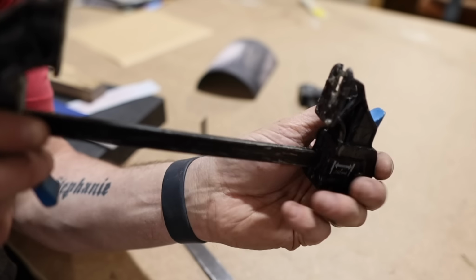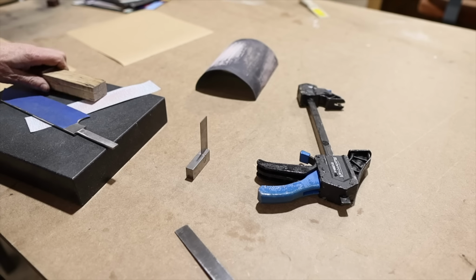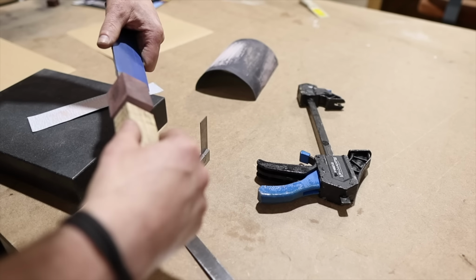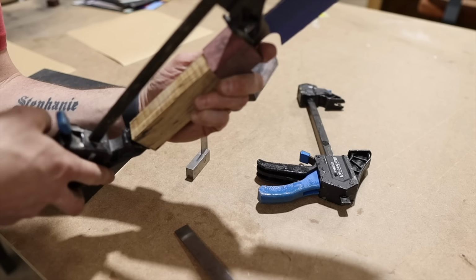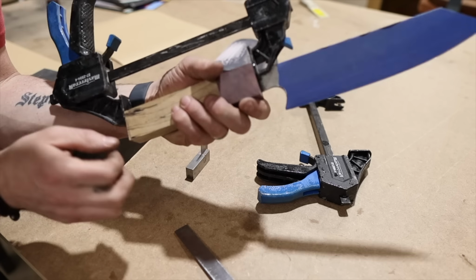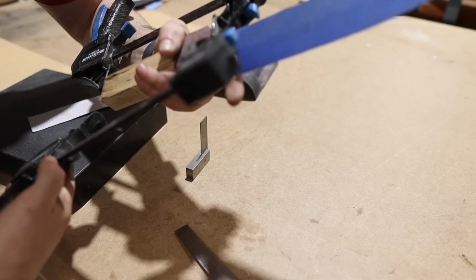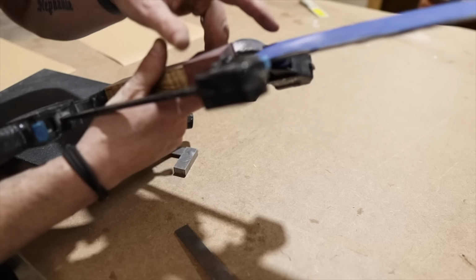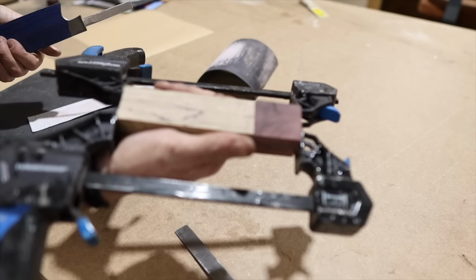So these are the custom clamps and basically I just cut a groove right in there. I got this idea from Noah Vachon. And essentially, once we get all the epoxy in here, everything glued up, put together, then this clamp will go over just kind of each side of the blade like that. See how the blade's up in there? I'll clamp that, and then this one, we're actually gonna have to come at an angle with this one. We can still get really close to the blade, front and back. And then once the epoxy's almost kicked off, you can just go, and that'll stay.